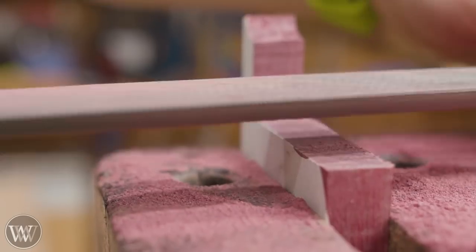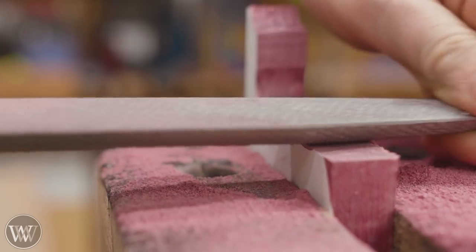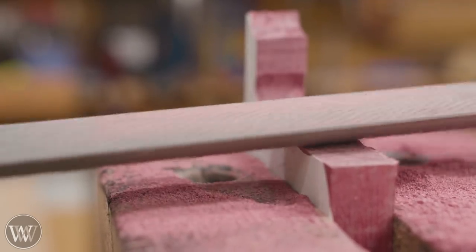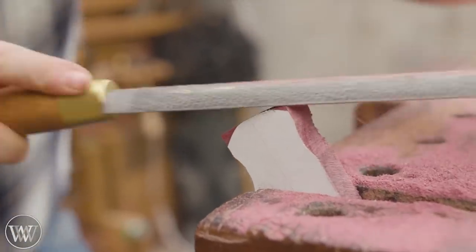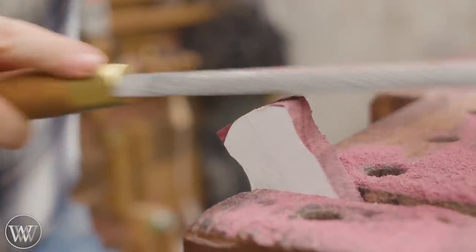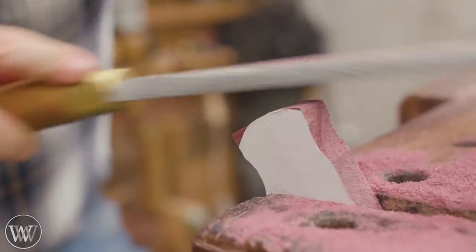Once we have all of this cut out we can start doing some of the detail work and getting it right down to the shape, particularly on that top. You could file it back, you could chisel it off, but in this case I just went out with a rasp and cleaned it down. We want to give clean transitions from those straight spots to the rounded spots. Originally on those rounded sections I was going to drill them out, but it actually just took a few passes with the rasp to get them down to the right shape, and that came out really well.